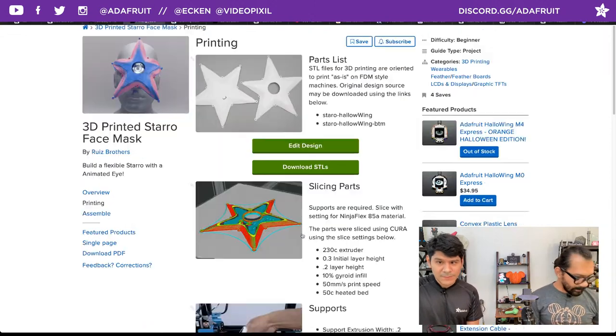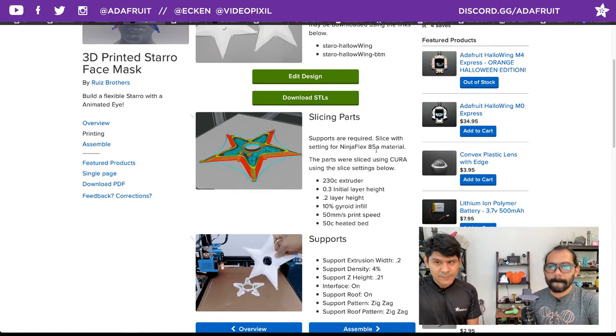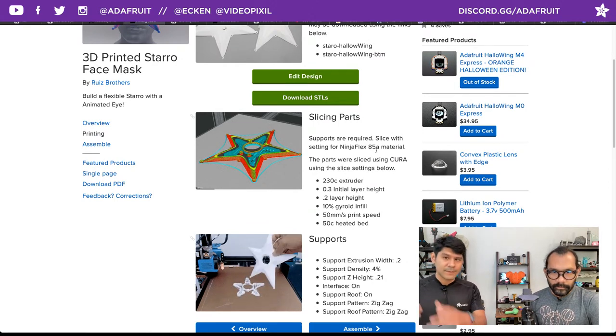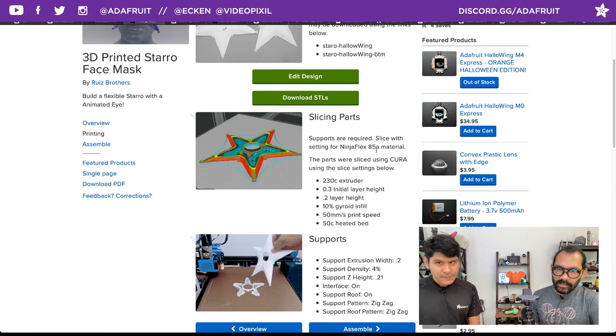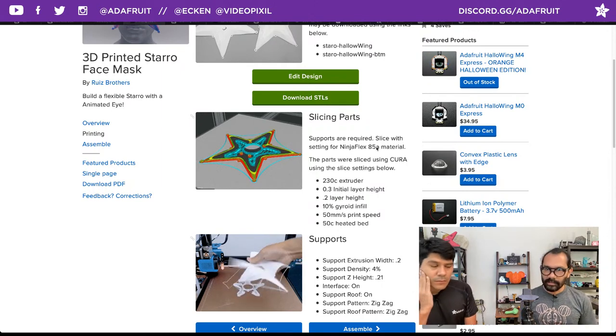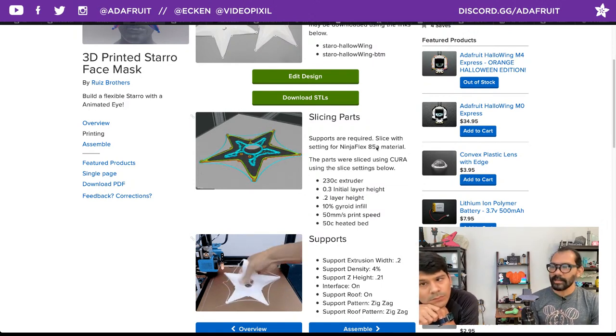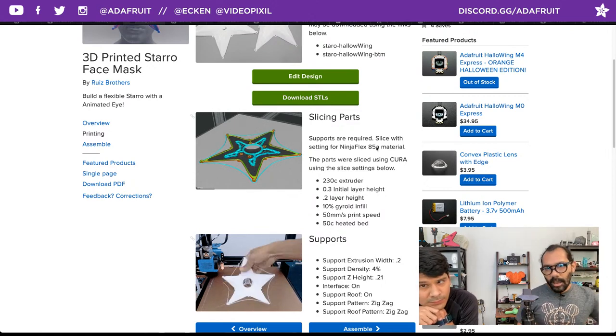All right, so in the 3D printing page, you're going to find all the settings that Peter's used in this model. So 85A is the Shore hardness for the NinjaFlex. Yeah. There's different ones. You can use Cheetah. Yeah, they call it TPE. So you can use TPU, which is what some of the other flexible materials are. It is not going to be as elastic if you use those other flexible brands, but it should still work for the tips to bend those around. It is thin enough that it should work. Go ahead and walk through each bullet point. That way you can visually say, here's why. Yeah, so why do you print at 230C?